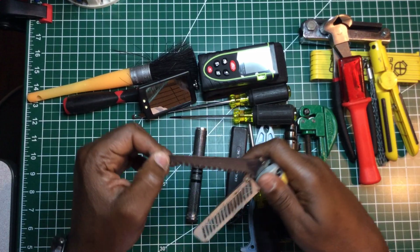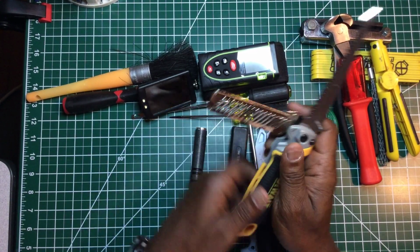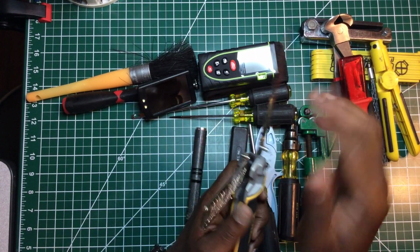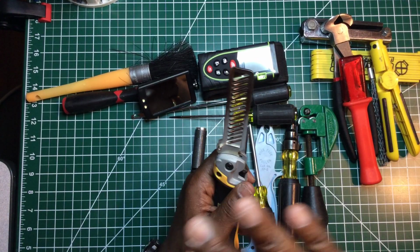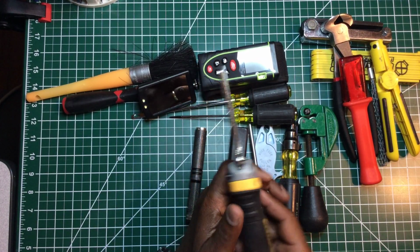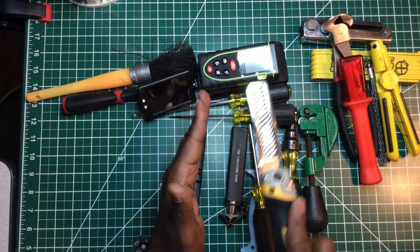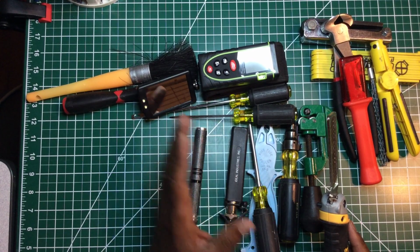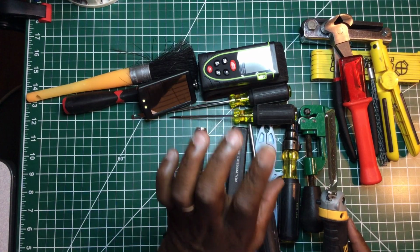This one not only has a sheetrock cutter, it has a shaver right here. If you're cutting it and it comes out all jagged, or you have to shave a little bit off to make the box fit just right, instead of going to get something else, you've got one here. Just shave off a little bit you need for your old work box, or whatever metal box you're going to put in the wall, to slide it in.